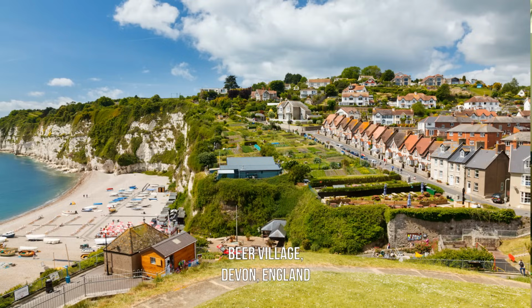The way that we're replacing this is extremely convenient. I've been on a mailing list since about 2007 from a company called Jimmy Green Marine, based in the UK in a village called Beer, actually. What a cool name for a village. I know them well, I've bought from them in the past, and they've got a service where you bag up your standing rigging and post it to them. They've got several different ways of doing this. You can take measurements and send them those instead, but the easiest way for us is just to bag up the old rigging and ship it to them. They do all the measurements, check out all the toggles required and spec it all up for you, then they make the same rigging and send it back to you, and you just stick it on.